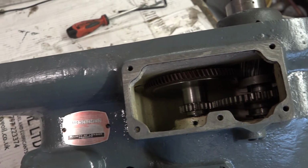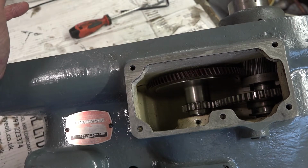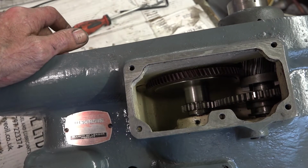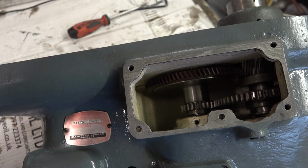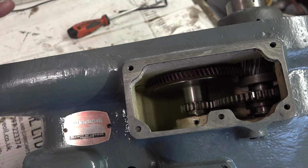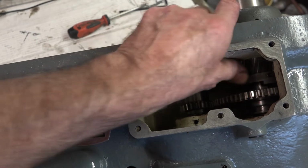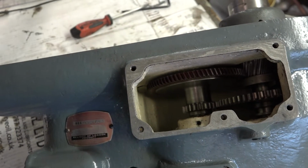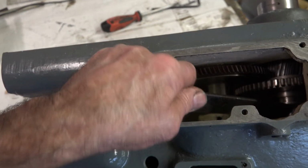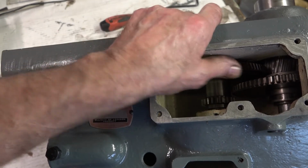About 3 hours later guys, I had to take just everything out again, the oil seals, the bearings, the shafts, everything, because something just wasn't seating right. I don't know what that was, because I've just assembled it exactly how I did before and everything is spot on now. Something somehow moved, I just don't know, but everything's right now, sweet. The dog gear just slides up and down really nice. Oh, there you go. Yeah, that slides up and down and just engages with that top.